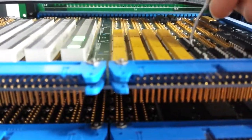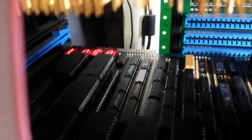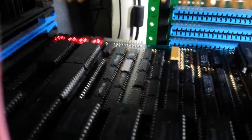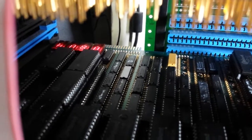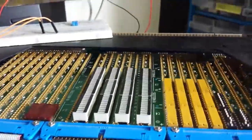We can also call an interrupt — if I flip this switch and show you the digits, it will jump to the interrupt handler. It saves the program counter on the stack, does everything it needs to, jumps to the interrupt code, and when it's done it jumps back to whatever it was doing before.